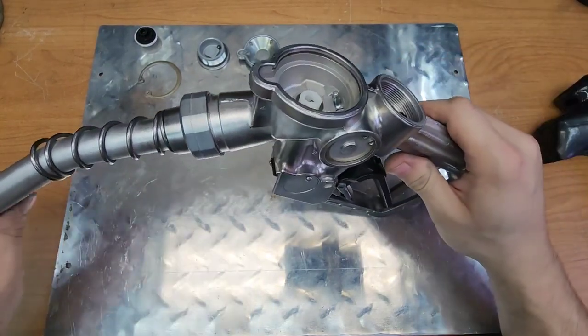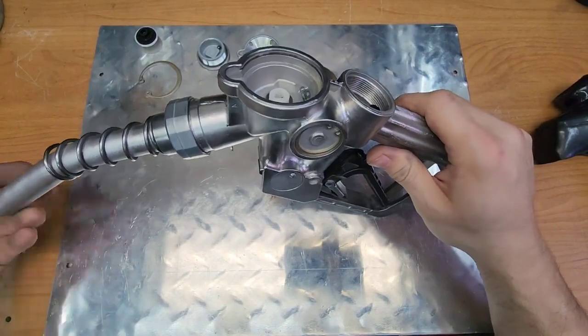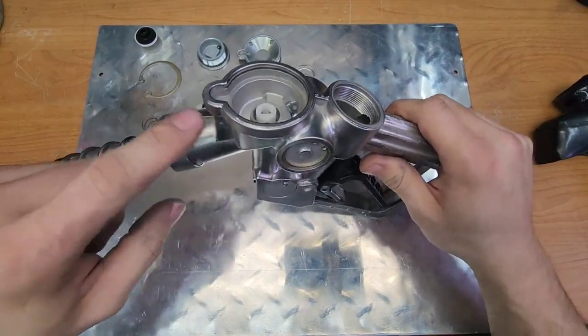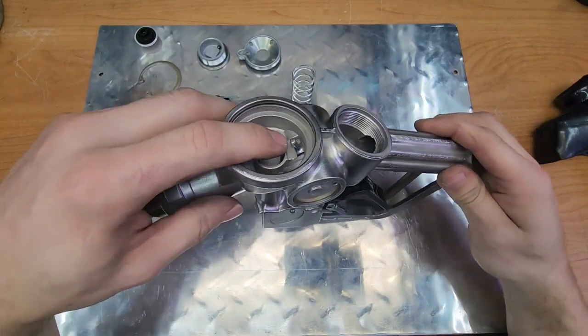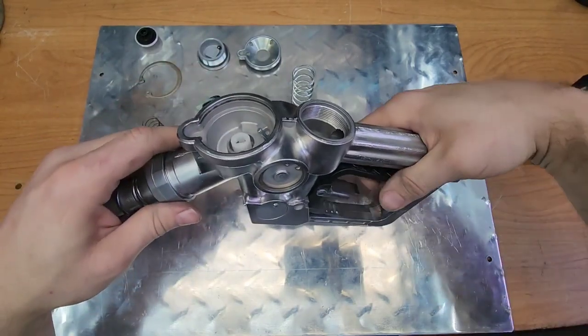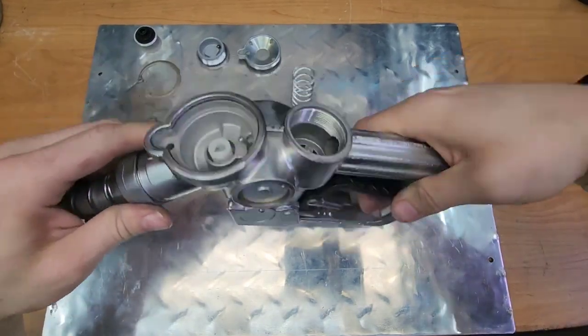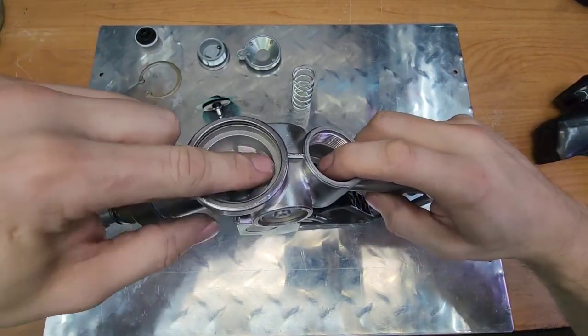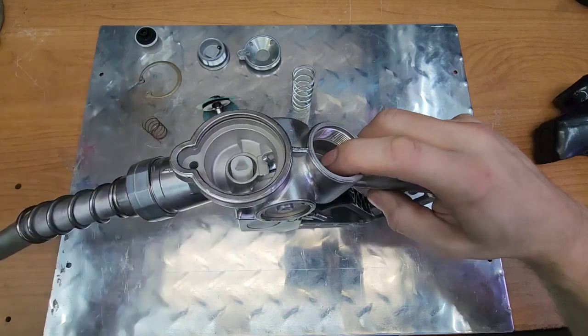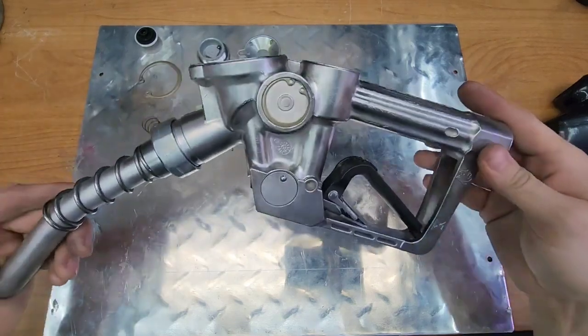So anytime that nozzle gets blocked for any reason because of the fluid or it's not sitting in your tank right, that causes this to trip out, causing it to shut off. Now, why will it not reflow again? Well, we talked about this little diaphragm here. You have this thing closed. Notice I'm not actually opening the valve inside. It's not allowing me because this hasn't tripped. This has to fully reset for this pressure thing to reset it to allow you to pull the trigger again, which is a genius design.